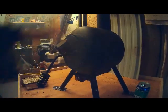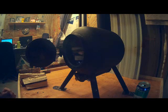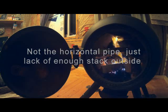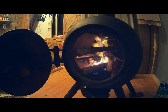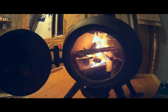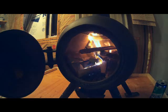Apparently those elbows made a huge difference in draw, because that horizontal section of pipe is making it burn poorly. That is not acceptable — nothing like it used to do. Smoke is coming out the door. I hope I can rectify that situation. It needs to draw. Once it gets hot I'm sure it'll go — and it is going now — but I can't be filling my room with smoke every time I go to start my fire.